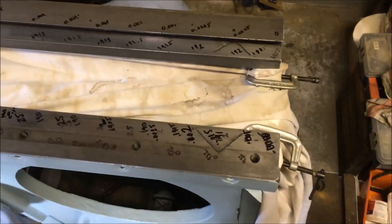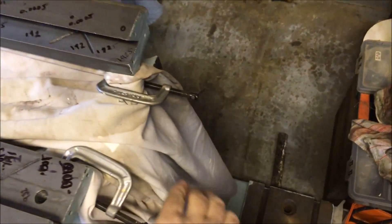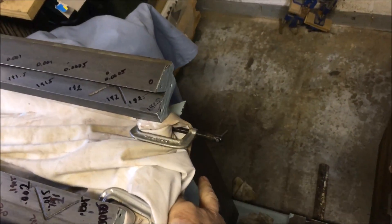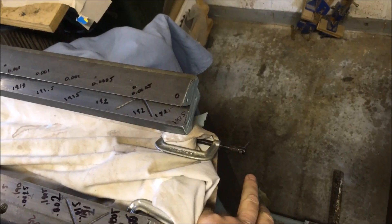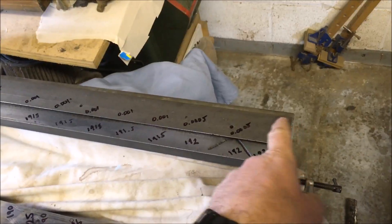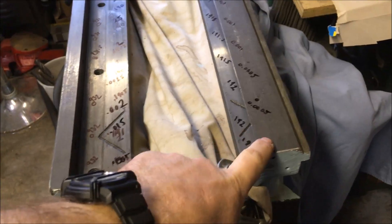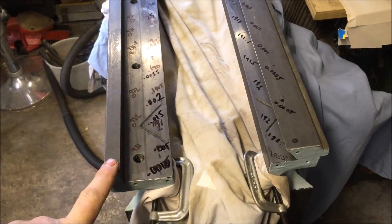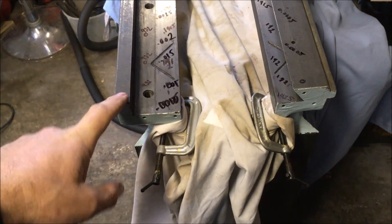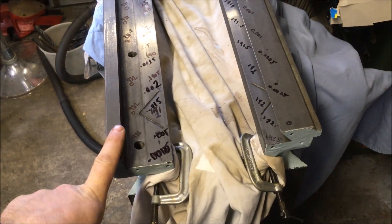In the cold chilly workshop, we've been spending some time mapping it out. We've stoned off the front verticals, held a parallel against that, then put a t-square against that, and checked that face and that face — which are the original machine faces. I would stone them off as well; as far as I can tell they're at 90 degrees to the verticals, which is handy.